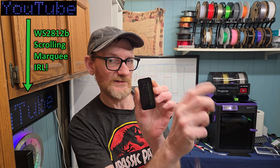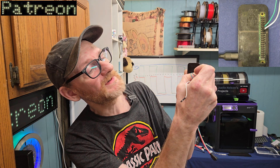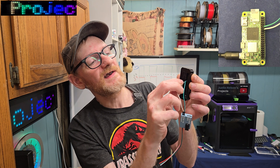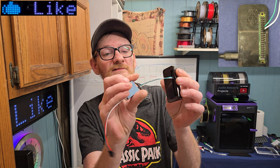If you orient it so your pin header is to your right and take the right-hand row, count down: one, two, three, four, five — the sixth pin down is GPIO 18. And the next pin down on the same side is a ground wire, so you've got a nice data and ground pair.